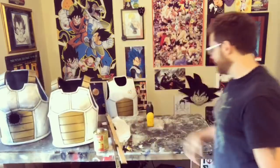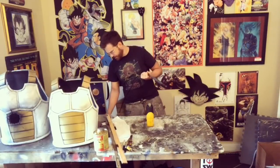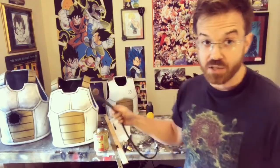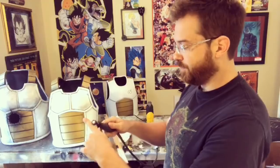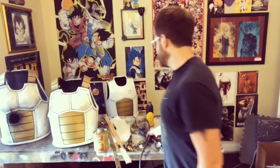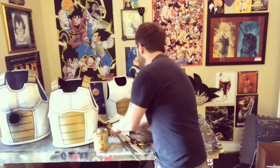Back here on my hook, I'm gonna break this out. It is my Dremel tool. On my Dremel tool, I have a snake end here, so it's very flexible for me to work with. On the end, I have a drum sander with a 120 grit sand drum. I don't know what to really call that. Anyways, this is what bevels and cleans up my edges, so I have nice convexes, and when things come together, they're nice and clean. So we're gonna set the Dremel aside right now.